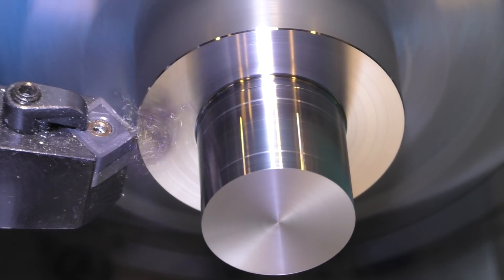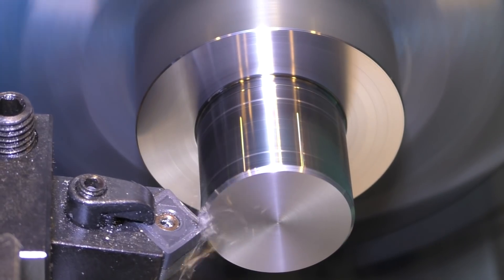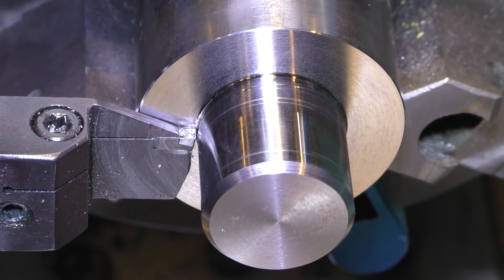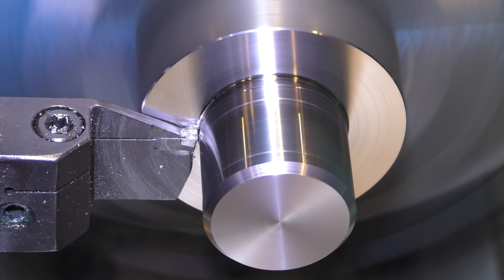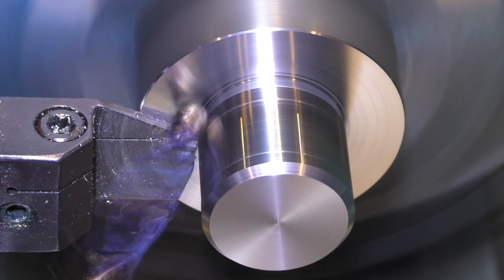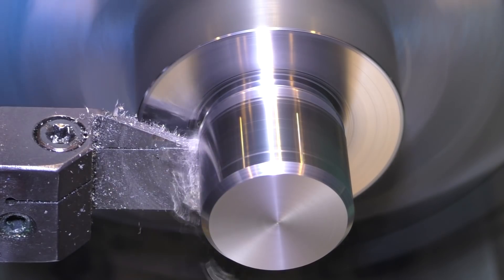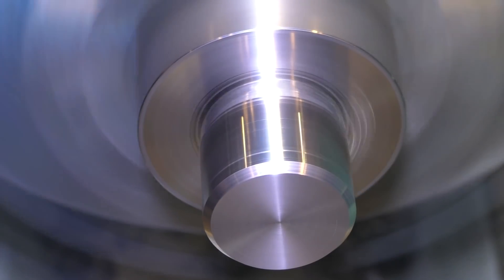Now the chamfer — a little bit for one edge and a lot for this edge because this is the threaded side. We're going to do the back relief and try this at high RPM. I need to go in about 100 thousandths and I'm going to lock my longitudinal travel so it won't move. Let me get in a little further — we need to go in a total of 100 thousandths. Next up: single point threading.